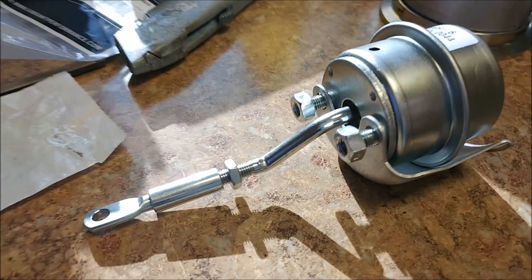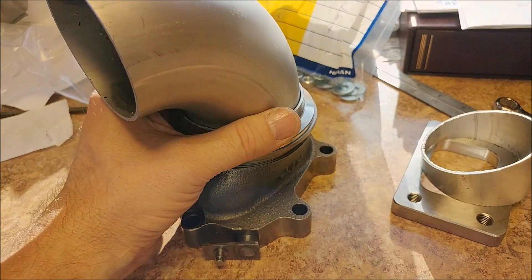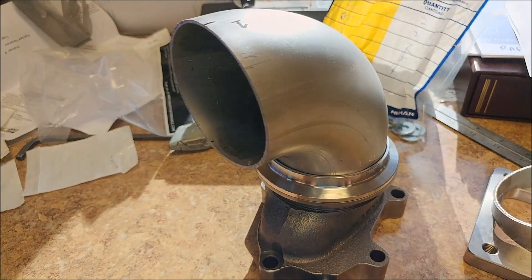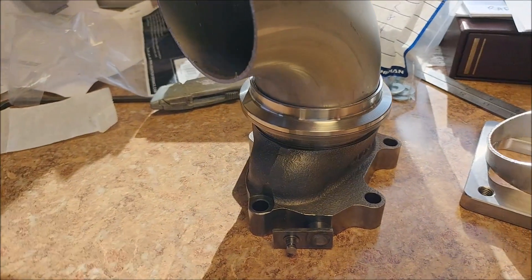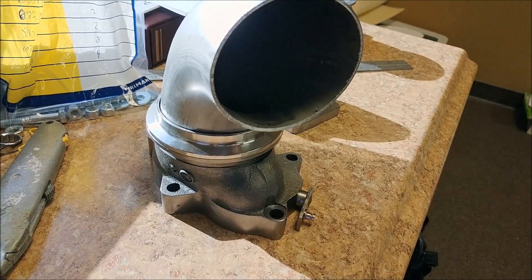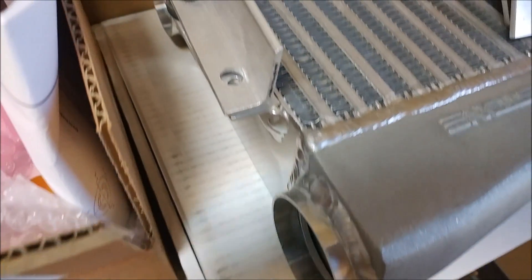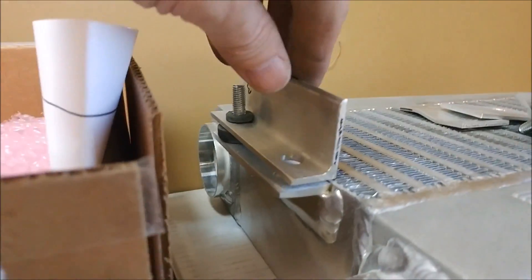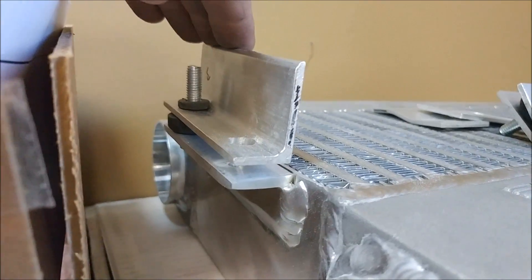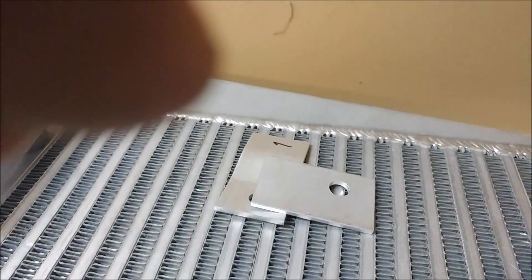It's a really ingenious little system and should work great. You can see the three-inch v-band connector there — that'll hook up to the outlet from the first turbo, and the 90 will get the other 24 degrees added for 114 degrees total, then the intake adapter onto the second turbo. I also did some work on the intercooler today — cut an inch and a half off the intake pipes because they were too long. We're going to weld on some radii to make it fit better under the intake cowling. Here's the bracket that'll be welded onto the radiator.